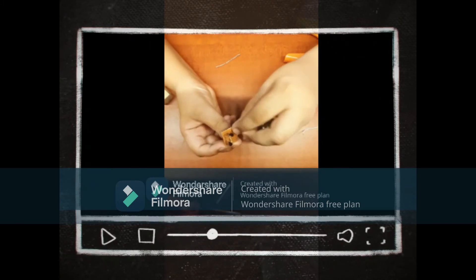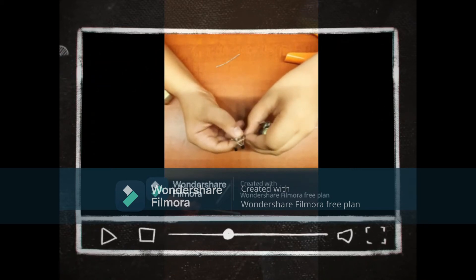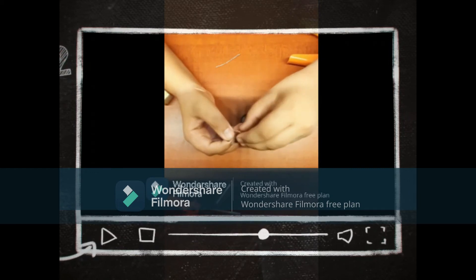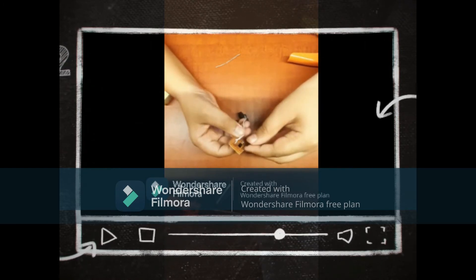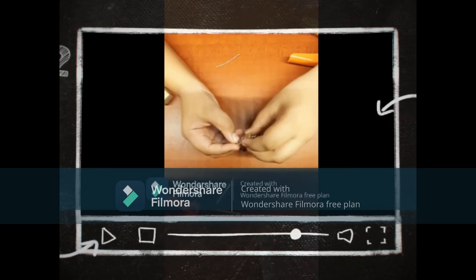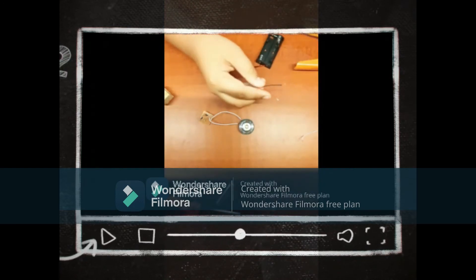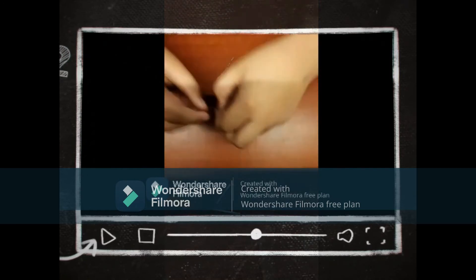All the pins are now connected. The resistor is connected to one pin of the IC and one pin of the transistor — from the transistor it's the base pin, and from the IC it's the output pin. The ground pin and the emitter pin are connected together. The speaker is also connected, so now we'll connect the battery pack.